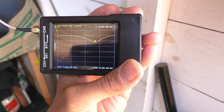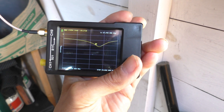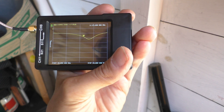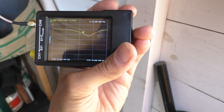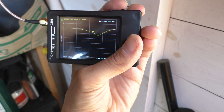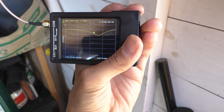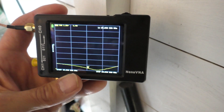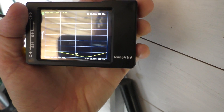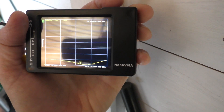On the FM channels chart, 27.6 MHz is down low — around channel 4 or 5 — so that's a little bit high. I like to use 27.305 MHz as my chosen channel, and moving up to around 27.320 MHz it could be a little bit better — it's not quite resonant on the frequency I want. There's room for improvement, and I do need to give it a service as it's starting to splinter and needs a coat of varnish.